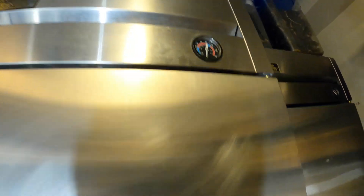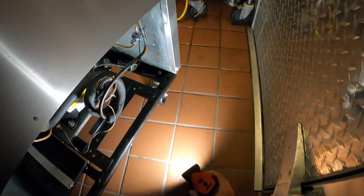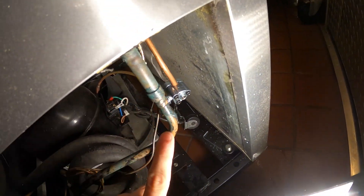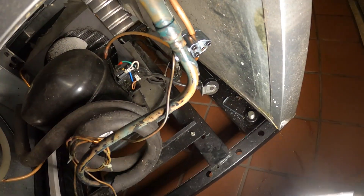Alright, here's the box — let's pull this thing out. This thing is on wheels, but the best way to work on this is from the back. If you guys can see, I've got the piercing valve here and I took off the insulation. The leak is right here at this reducing coupling.